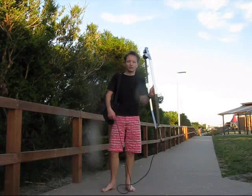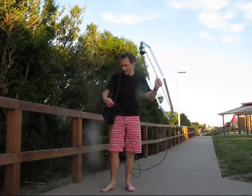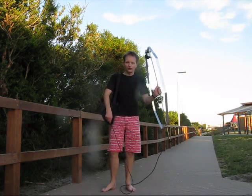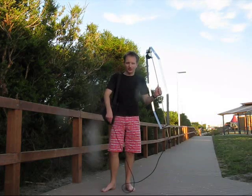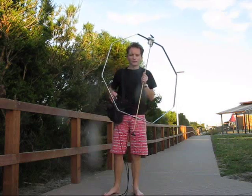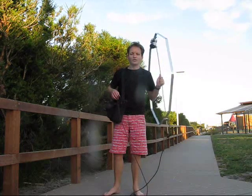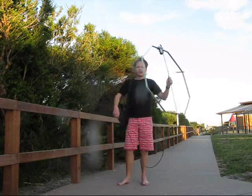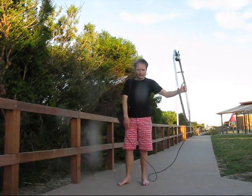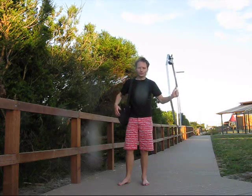One thing I found important when operating pedestrian mobile is the length of the lead between the radio and the antenna. If it's too long, it dangles, and the results are something like this. And if it's too short, you may put stress on the radio's antenna connection when you are swinging the antenna around. If you hold your arm out like that, the wire must not quite touch the ground. And to keep it out of the way, it's a good idea to loop it behind your neck.